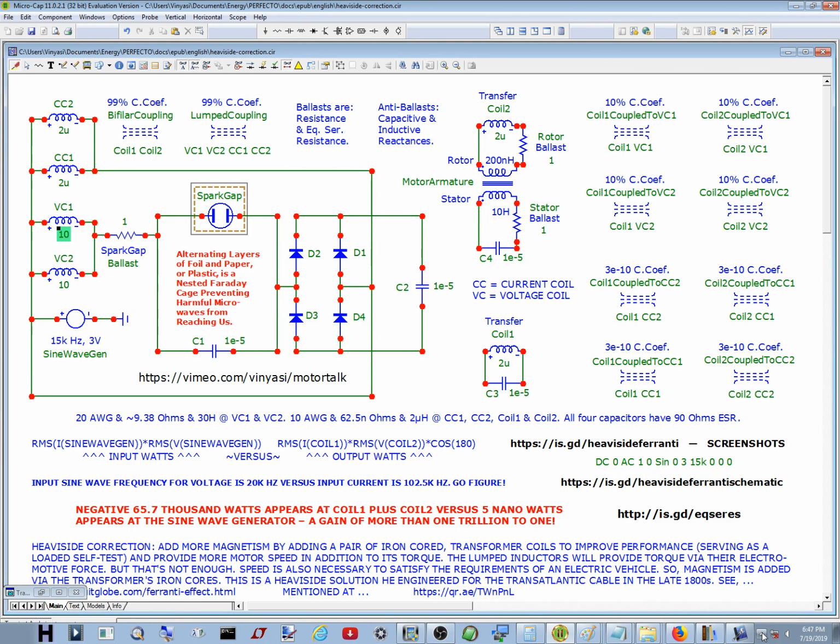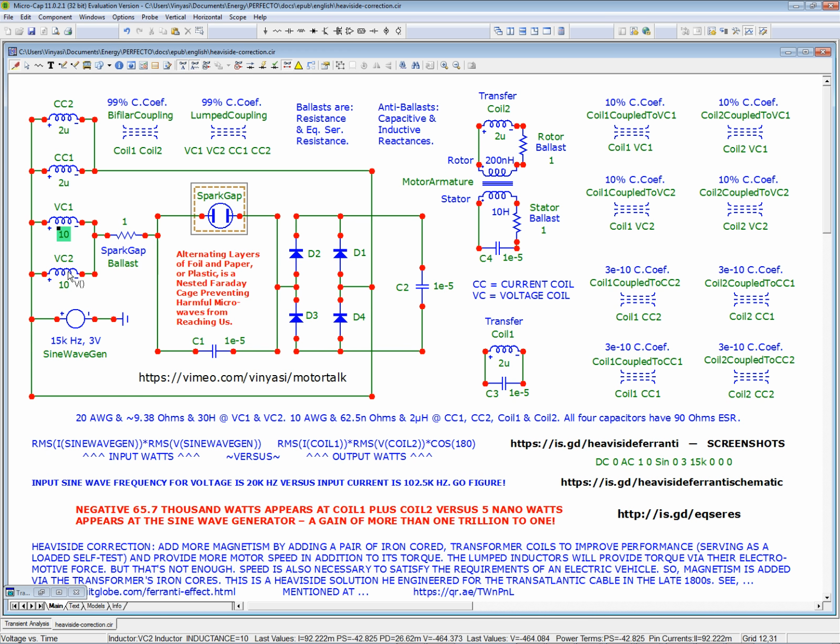So I guess I had it wrong. It's frequency that can get in the way of me lowering the henries, the inductance on these coils. But I try to lower these first. That's my first option because I get a nice lowering of wattage when I do that. But when I lower the capacitors, I actually get an increase of wattage. Not just an increase of amps over volts in a ratio, but overall I get more power. And so my first option is to lower these coils, but if I get an error message from the simulator, then my last resort is to lower the frequency.